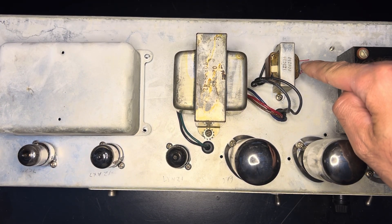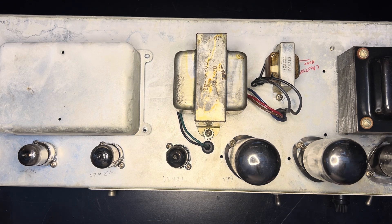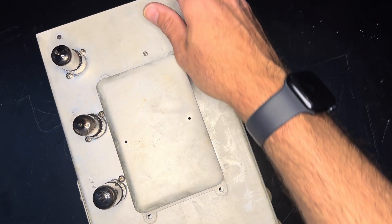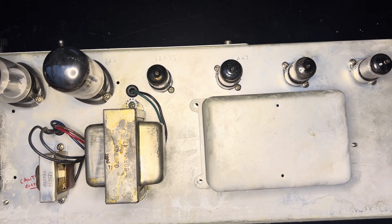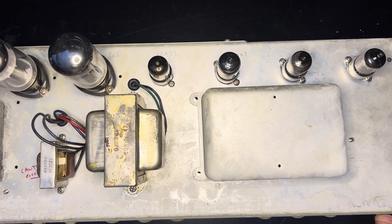The choke — you can see the nice little paper interleaved transformer here — is from the 10th week of 1962, which is awesome, completely appropriate. You have to ask: the things that killed this iron, does the potential for this iron to be damaged beyond repair still exist? And yeah, it does, at least in the form of maybe some suspicious tubes. Let's get underneath this doghouse cover and see what these caps look like.